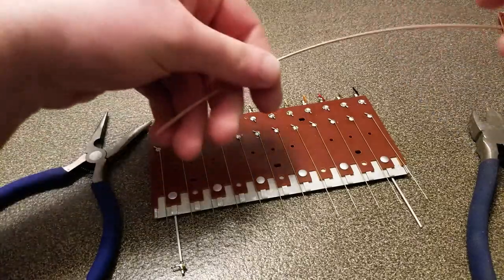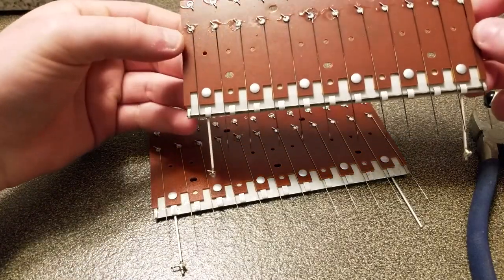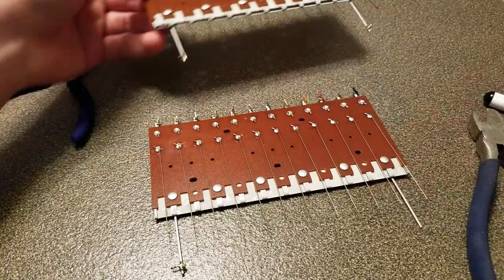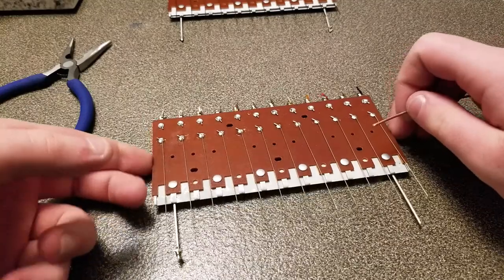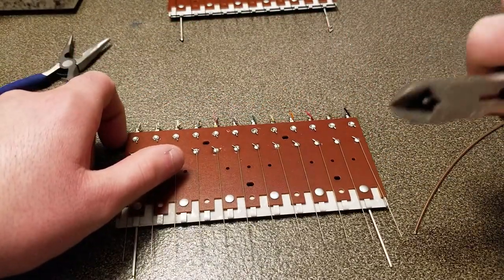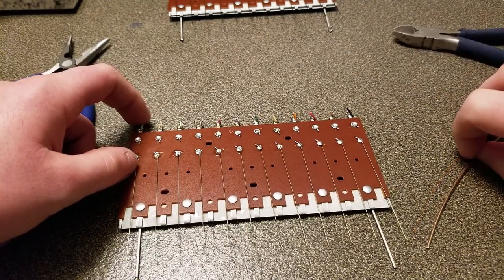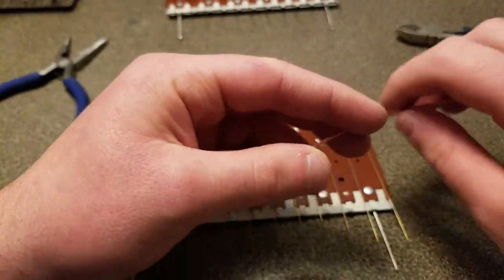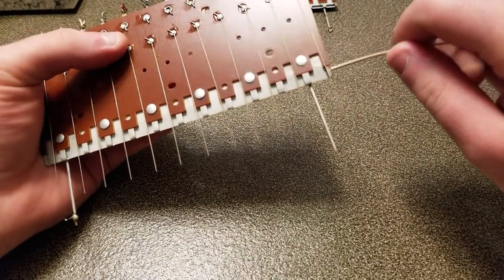Now we have to get the copper wire where the elastomer was. If you look at the silver rail method, essentially it's going to be the same thing — but instead of silver on silver, it's going to be gold on copper, and the effect is the same. Take the copper wire and make sure it's cut with a nice pair of side cutters, preferably side cutters over wire cutters, because they will make sure the ends of the wire are really nicely shaped, which will make them easier to get in.